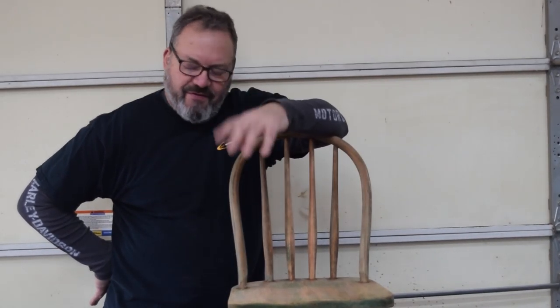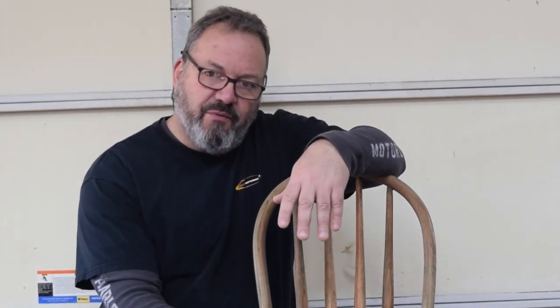We've talked about this before, and I talked about it with a client before I did it, but whenever you strip paint from furniture, you never have any idea what's underneath. Lots of times there's stains, there's damage, there's bondo — you just never know. And sometimes stripping the paint itself can be problematic where the pigment or dye in the paint leaches into the wood. In this case, we have an oak chair. Oak is obviously an open-grained wood, and at one point it had a green paint job, and then it was painted red over top of that. The red paint came off; there was some dyeing of the wood with the red paint, but I was able to get that off with some sandpaper and a little elbow grease, but we've got a problem with the green paint.